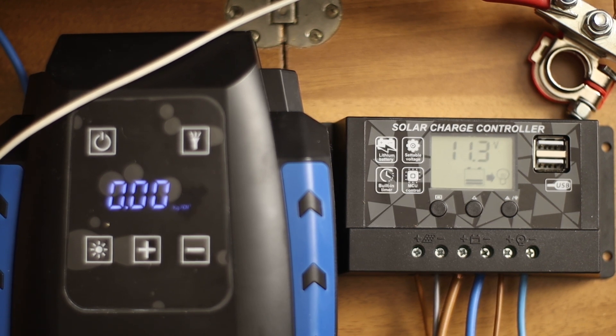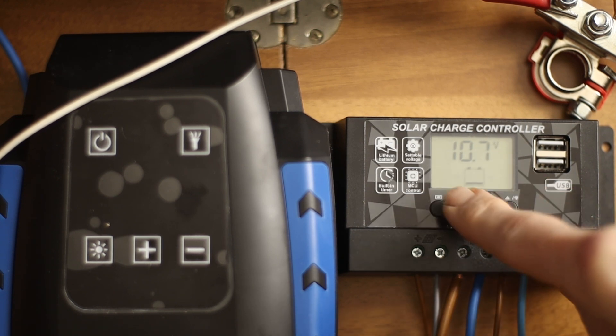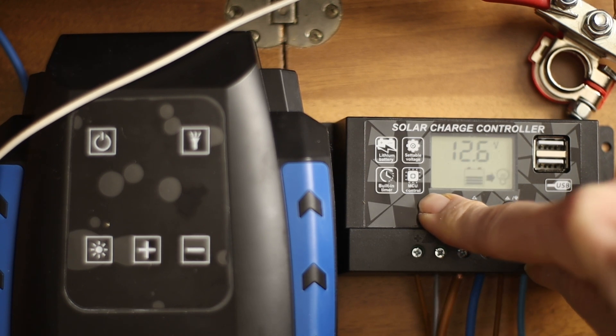It's really great to have such a power supply. Yeah, it works. Yeah, it's off. Okay. If we go up again, it should go to this voltage — yeah, you saw it: 12.6. This is the floating voltage when it starts to slow down charging. And this is the voltage where it will reconnect the users, because it will not reconnect if it goes up to just 11 volts again. It wants to give the solar panel a little bit of time to go to a decent level — so this is 12.6.